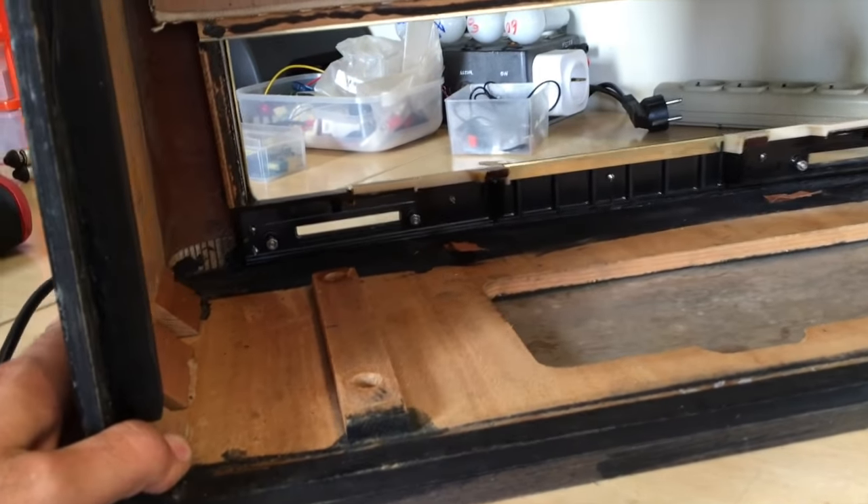The two smaller speakers are now in place. You'll notice the capacitor wired in there — these two speakers are actually in series with a 47 microfarad non-polarized capacitor. The original specified 50 microfarad with 5-ohm speakers at 50 microfarad, giving 10 ohms in series. I believe it cuts off everything below about 300 hertz. With my system, these are 6-ohm speakers — 25 watts, way over-rated in terms of power — so in series that's 12 ohms with 47 microfarad. The cutoff frequency comes out at pretty close to what the original was.